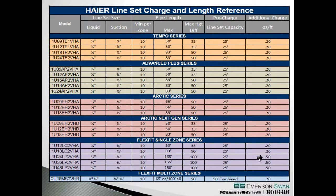A lot of manufacturers have phone apps where you input the model number and line set lengths and it tells you if you're within the minimum and maximum parameters. For multi-zone units, some apps total all the inputted line set lengths and tell you if you're within the right parameters, and if you're over the pre-charge, it calculates how much refrigerant you need to weigh in.